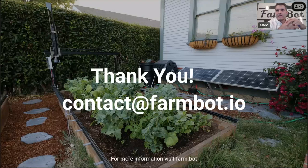So the current model of FarmDuino uses an integrated Trinamic TMC2130 stepper drivers. And these stepper drivers have proven themselves in very challenging environments, and they just are awesome. They are such an improvement over the Genesis version 1.4 models that we had. Not only are they fully integrated and super reliable, they also have allowed us to use an ultra quiet mode.